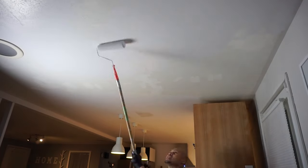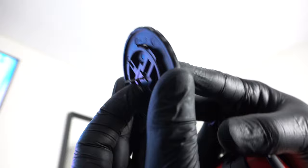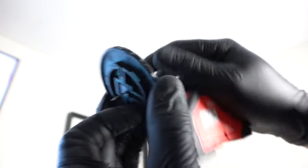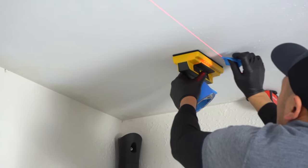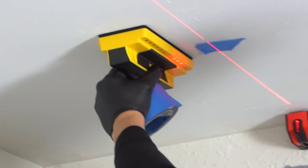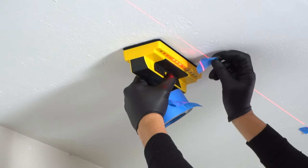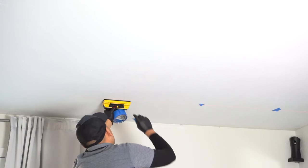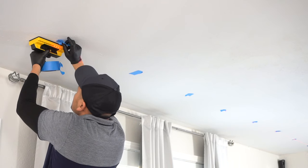I finished putting on the paint and letting it dry — it now has a nice texture. I'm using the Craftsman laser leveler, which has a pin on the bottom so you can attach it to drywall. While it's pinned, I'm slowly using my Franklin stud finder to locate the joists on the ceiling. It hits everything right on the spot, and I'm marking the joists with masking tape.